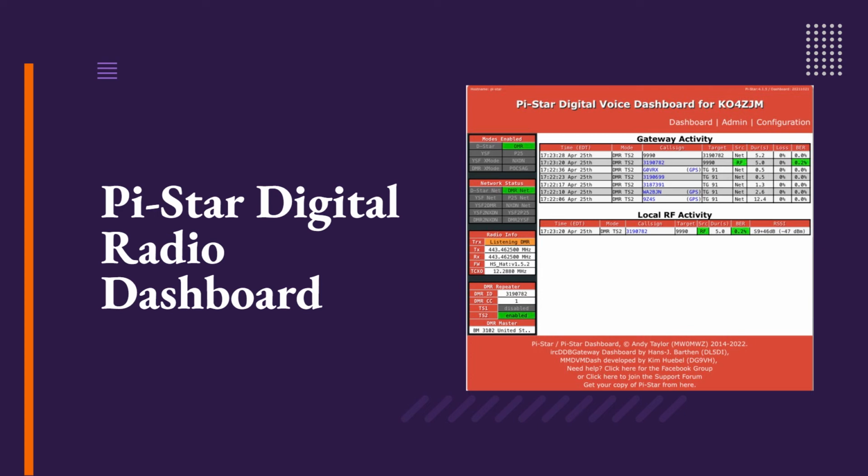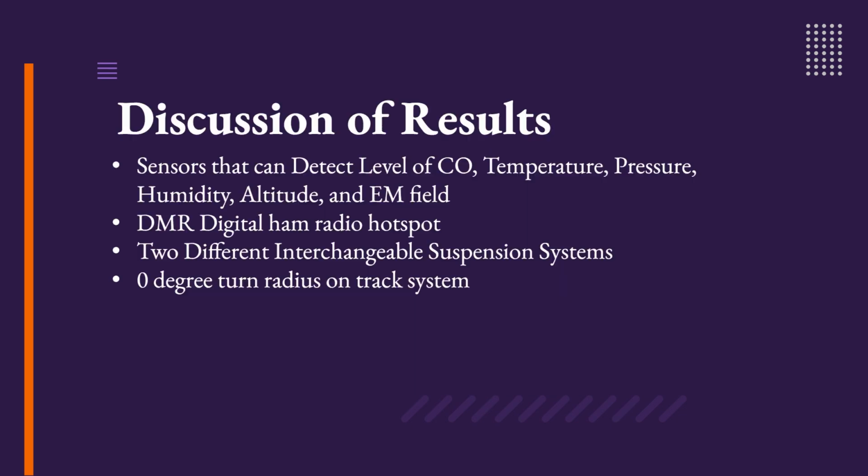The Pi-Star dashboard is what the user will see whenever the hotspot is set up on the DMR web. A display allows the user to know if they are transmitting, actively picking up chatter on the net, or waiting for chatter. In addition, logs of all call signs that have accessed the hotspot are listed under gateway activity, and all the times local call signs, such as the user's, have accessed the hotspot are listed under RF activity.